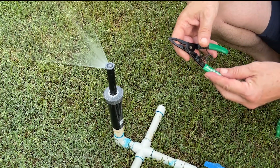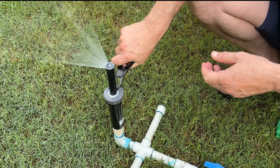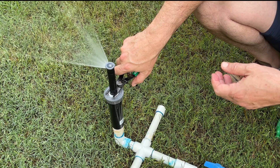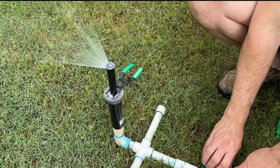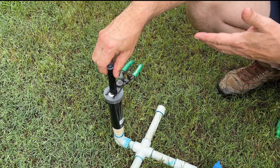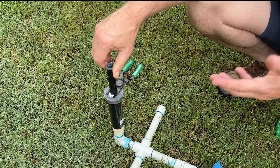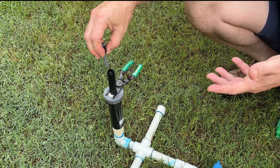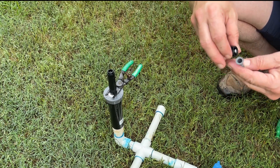What I would suggest you use is the Rainbird spray head tool. It's a clamp that's fitted just for the spray body shaft here, so you put that on there. We'll go back to the timer or use your app or whatever you've got to shut the zone off. I like to do several of these at once if we're doing a tune-up or an adjustment on a zone. If there's more than one nozzle to replace and flush out at one time, I keep several of these on the truck so we can do them all at once.